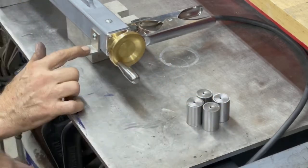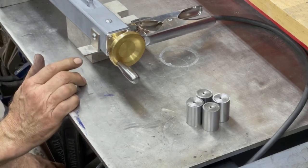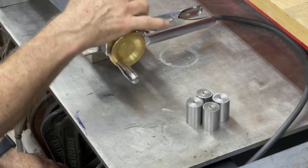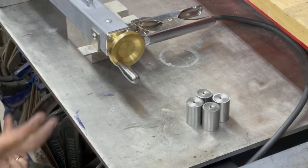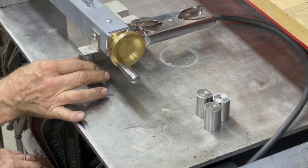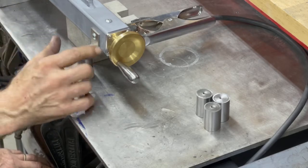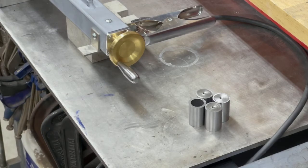And this piece of stainless steel bar stock, one inch by 1/8, right now I have it bolted on here, and I'm gonna go in and tack the corners. And then once I get it tacked, I take it off and I weld it all and finish it and put it back on. And there'll be some contouring, because these guys are going to be under here like so, welded on. And so I want to make these corners all the same shapes. Yep, that's the plan. Stand by.